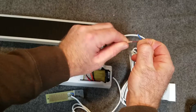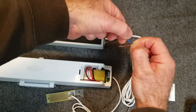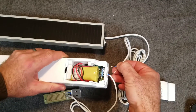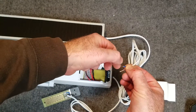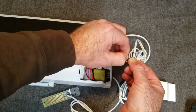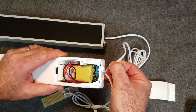Separate these a bit, give them a twist. Insert into the corresponding hole. Make sure you give them a good twist — especially on the solar panel, you don't want any loose strands crossing the positive and negative connections when you insert them into the hole.